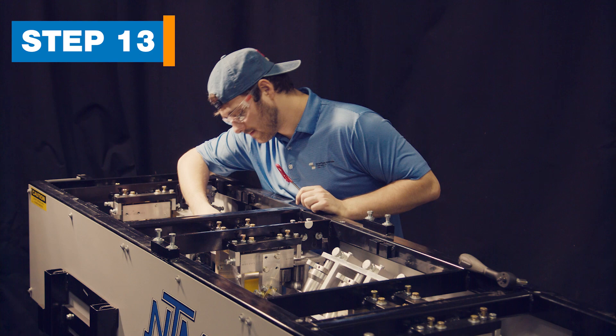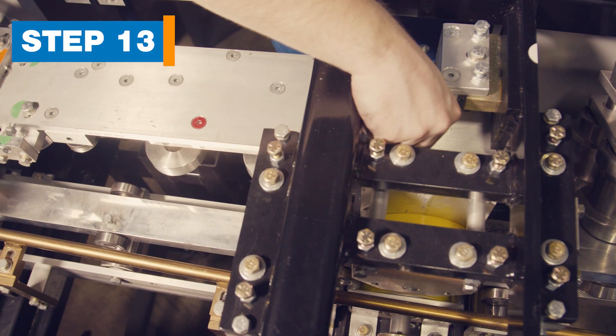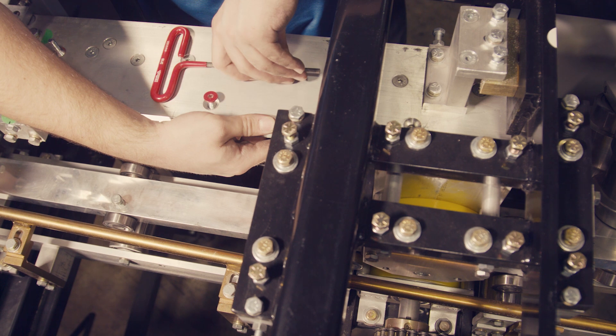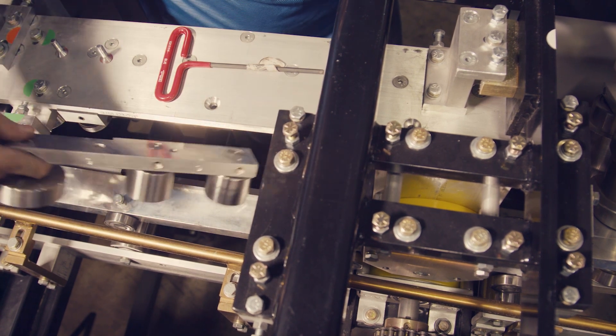Step 13. Remove the 6-inch inside box roller bar assembly. The box assembly is located just behind the cover that was removed near the main controls. This assembly is held by two allen head screws that are painted red. Remove these screws while supporting the roller assembly. Slide the assembly out and set it aside.